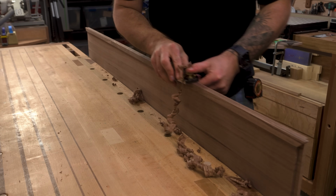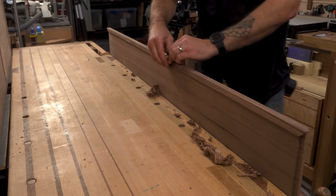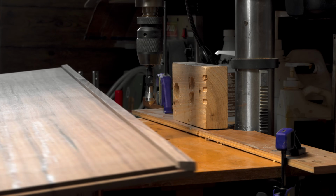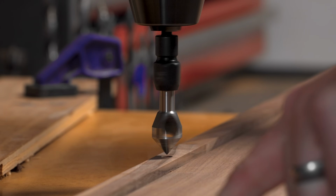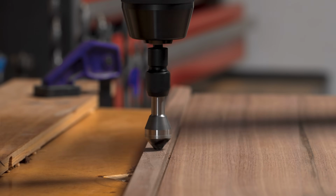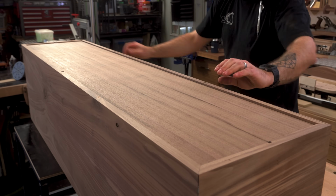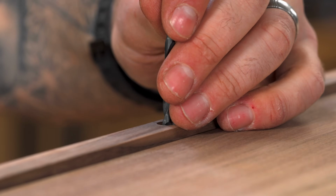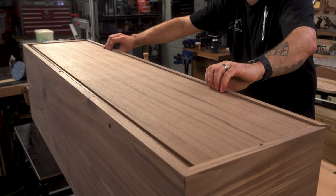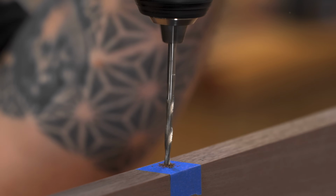With the same theme as the front of the case, I tack on a little grain matching strip that I set aside earlier to complete the frame around the back panel of the case. Details, baby. Details. And since this is going from high humidity in Oregon to my client in the desert, I'm mostly considering wood movement a la shrinkage, so I'm comfortable leaving a little headroom at the top of the back and affixing the back after it slides into place with a single, as opposed to slotted, attachment point. This is all assuming and accounting for the fact that that panel will move.